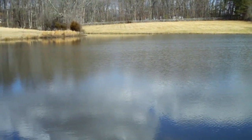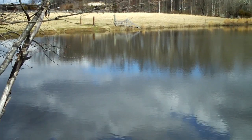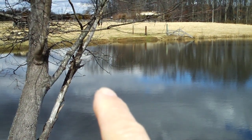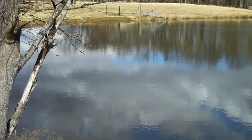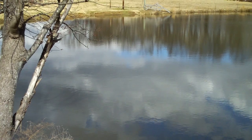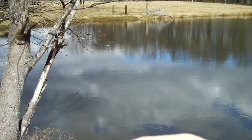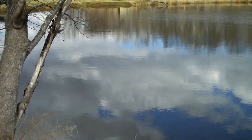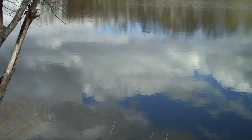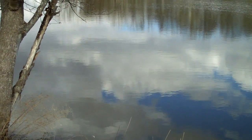We've had some rain, the pond is pretty full, and I have drain issues. Right about here should be a drain pipe — it's still there but not working anymore because I had to abandon it. About five or six feet down it developed a hole, since it's a metal pipe, so I had to block it off on the outlet side. Now until that can somehow be repaired or replaced without really draining all the pond, I have to manually drain it.